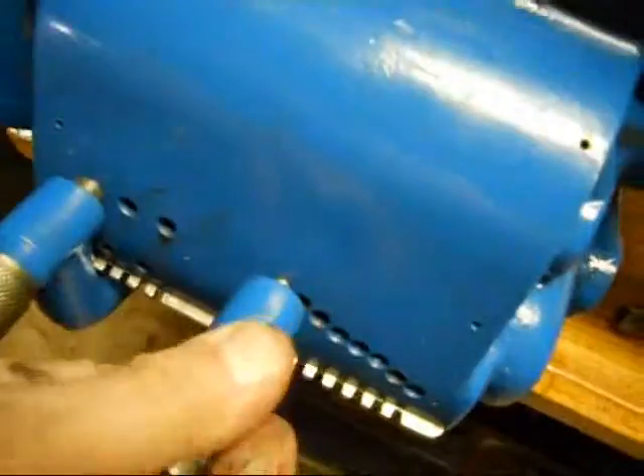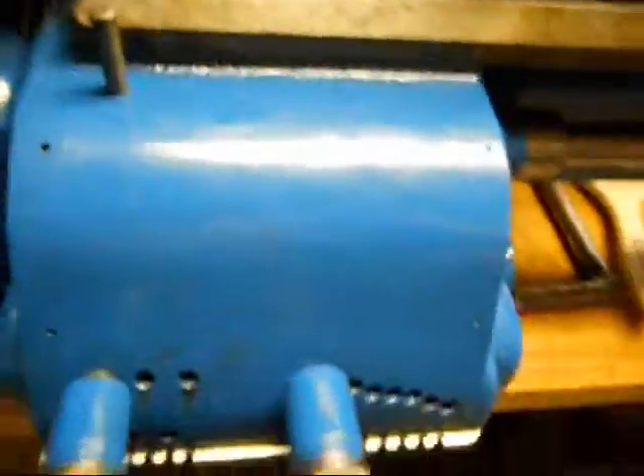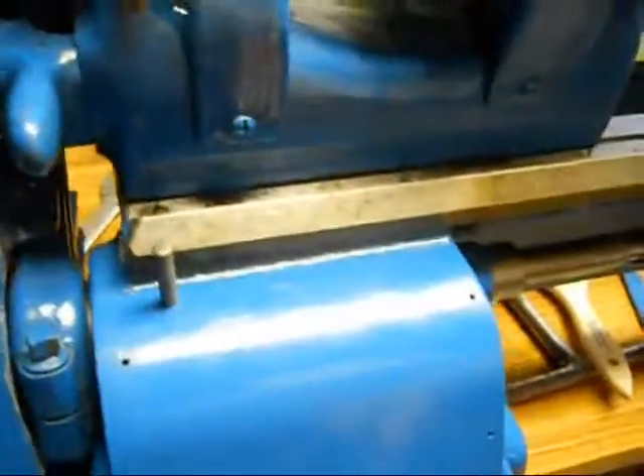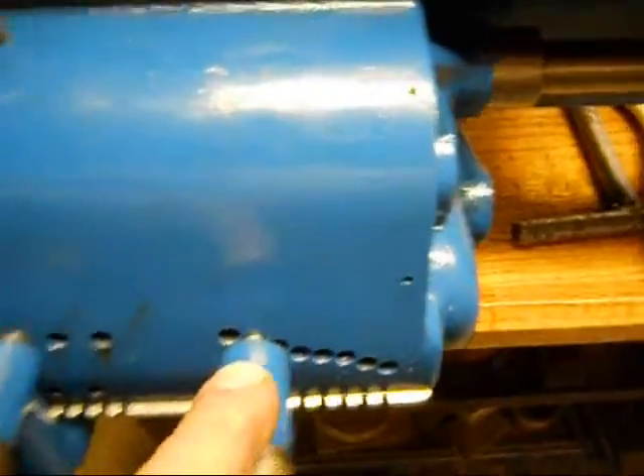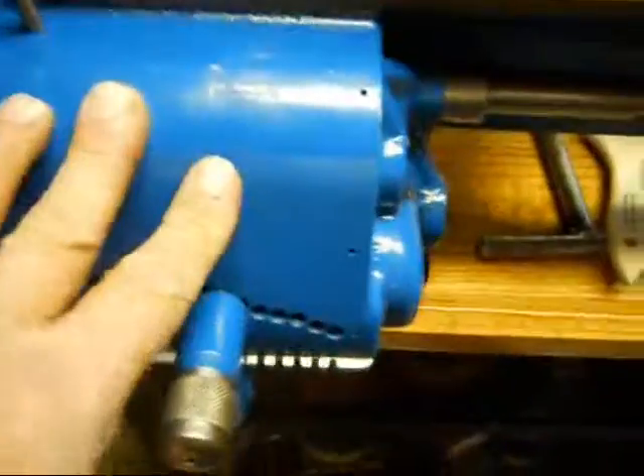If I move the right-hand tumbler — sometimes it can be tough to get out of those holes — I've now got it engaged in hole A, column 2. According to the chart, this would normally be sitting right here, and this would be for 4.5 threads per inch.